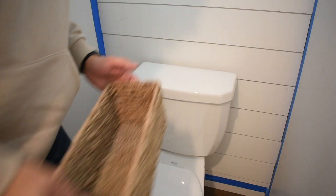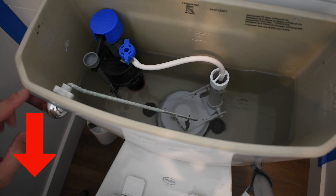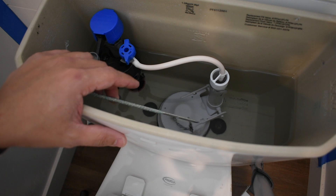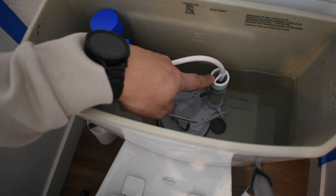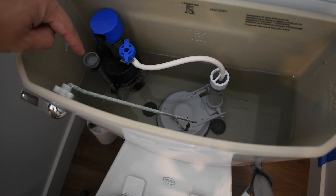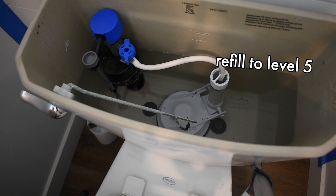Go to your toilet and take everything off the tank including the lid. Here are the simple mechanics of a toilet: you push the lever down, it lifts up the flapper, all the water in the tank goes down and pushes everything in the toilet down into the sewage line. Water refills from the hose into the tube, out the bottom, and refills the tank — all based off this little bobber. If I push the bobber down, it knows to refill the tank up to the level where the bobber then stops the valve.